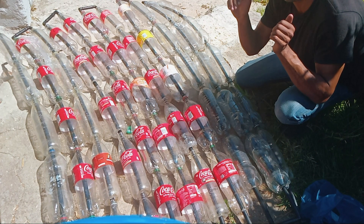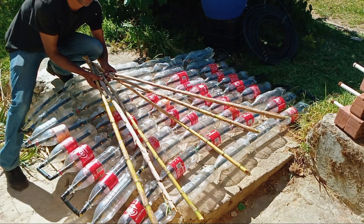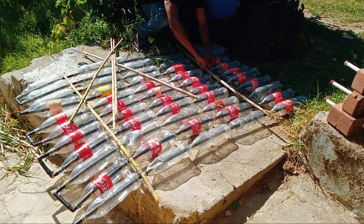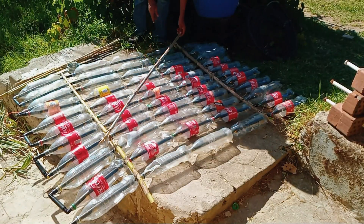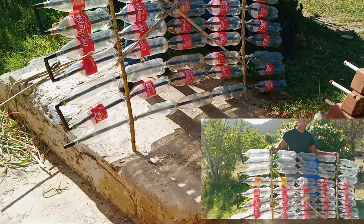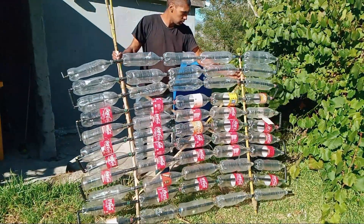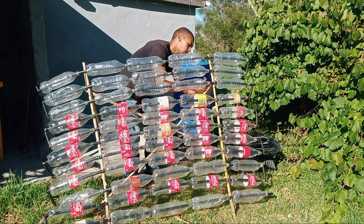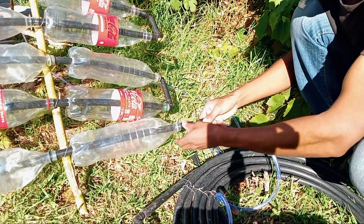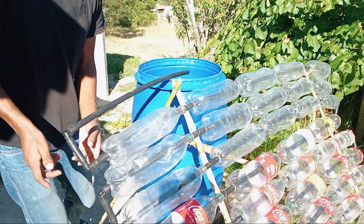I want everything to sit at an angle facing the sun, so we need to build some sort of structure to keep it all in place. I used a couple of these bamboo rods and wired them to the black tubes of the water heater, at the same time building a frame. Then I positioned the water heater into the sun and held it up with a few bamboo rods. I used an elbow connection to join the other end of the coil to the inlet of the water heater and connected a pipe to the outlet that goes into the container.